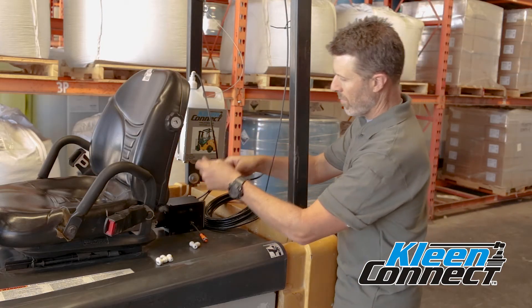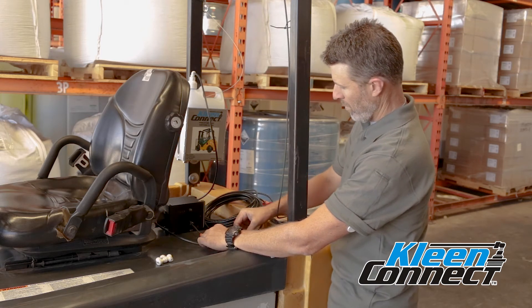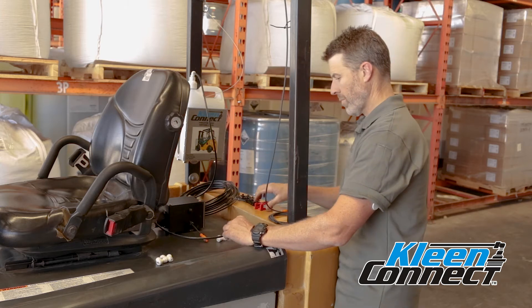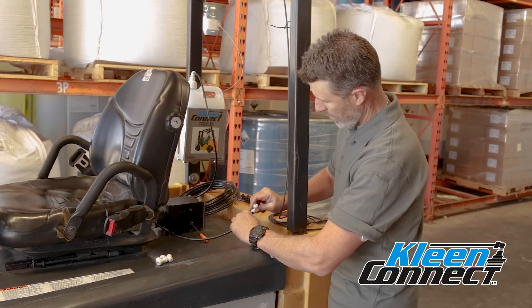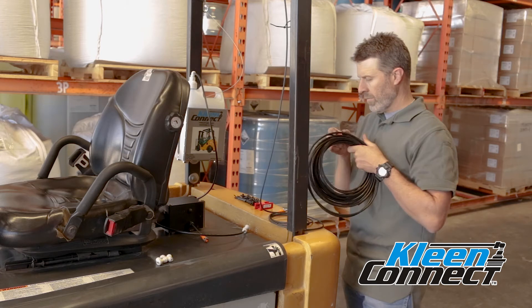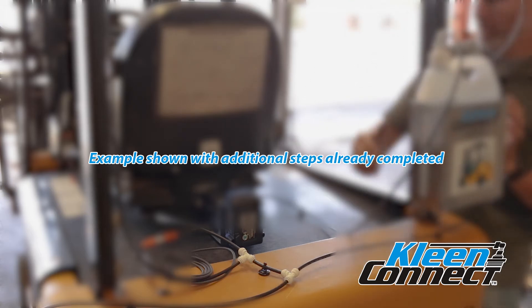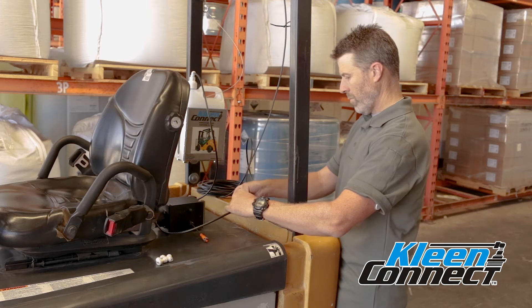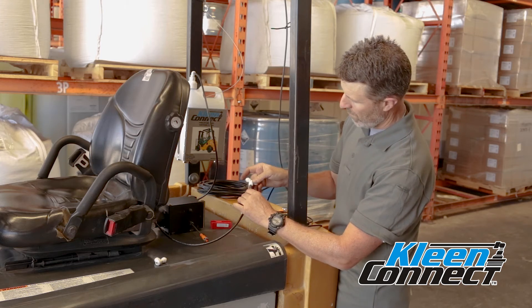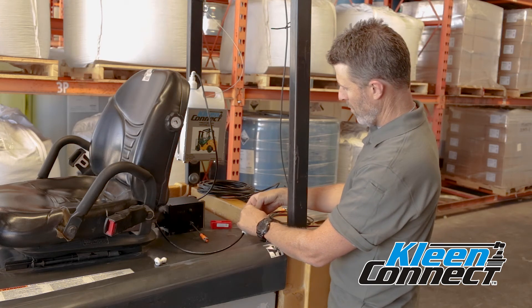Using the provided tubing, attach it to the open end of the discharge side of the pumping module. Stretch out enough tubing to reach close to the back counterweight at the rear of the forklift, allow an additional 6 to 10 inches, and cut the tubing. Select one of the three matching push lock tees and attach it to the other end of this tubing. This tee will be used to distribute the sanitizer to the front and back wheels of the forklift. Refer to page 5 of the installation manual to see the use of the tees in the system. Cut a 4 to 6 inch piece of tubing and attach one of the remaining two tees to this tee. The second tee will be used to split the sanitizer flow to each rear wheel nozzle. Ensure that the tubing is routed in a manner to minimize locations that could allow the tubing to be damaged.